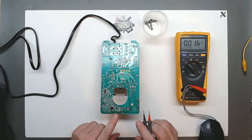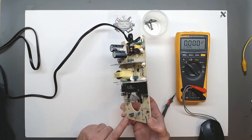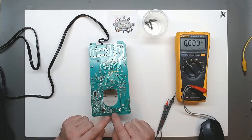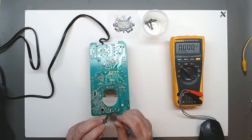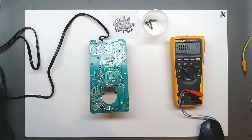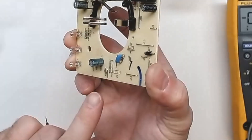While being very careful, if we look down here, we have a header — it almost looks like a programming header — probably going to this microprocessor here. We know our power is going to be down here for the LEDs. That looks like one of those little crystals for the microcontroller, that is X1. So we should have our 5 volts either in this area or here, and it's probably going through to both. With my voltmeter, while I still have it plugged in, I'm going to be very careful and check across. I am not getting 5 volts across any of those pins, and it almost looks like it says '5 volt reset battery.' We should be getting that 5 volts.